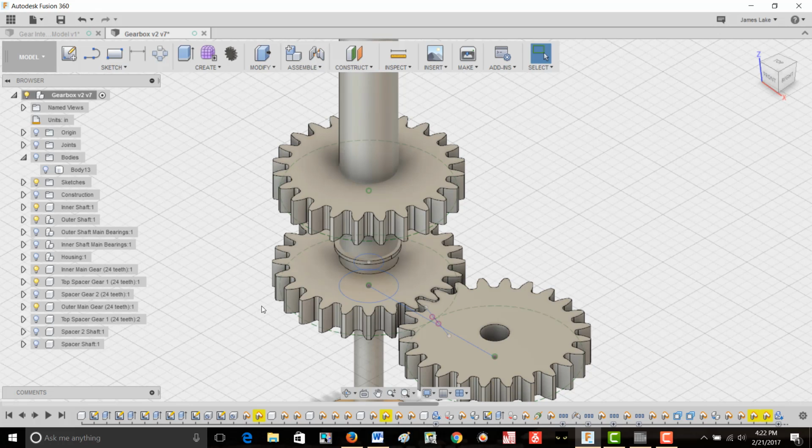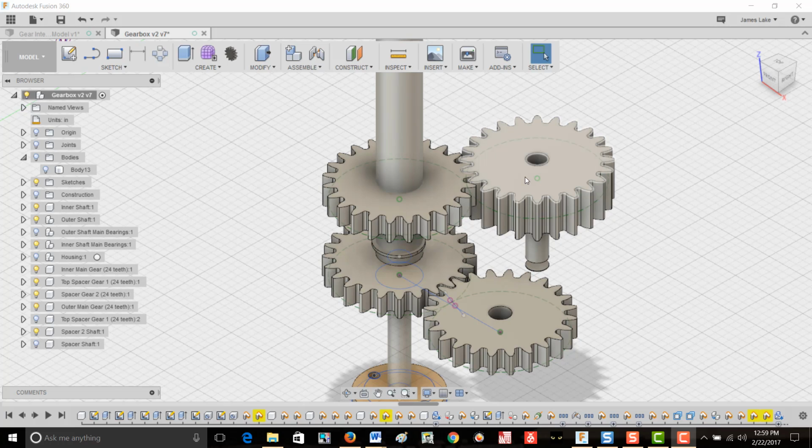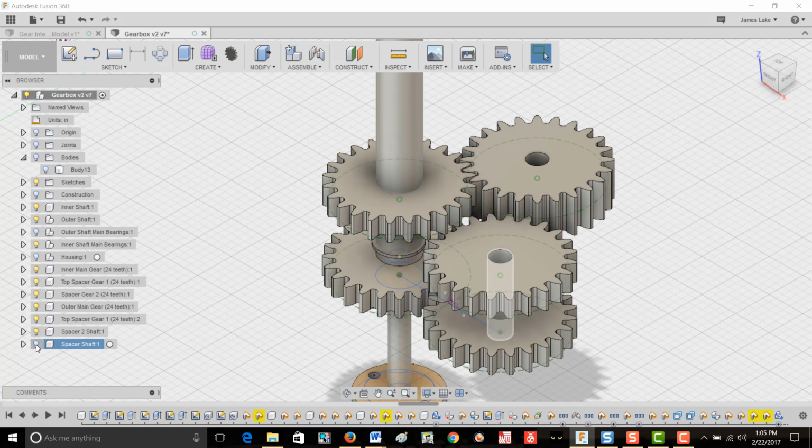It appears that we're going to need another idler to reverse the reversing action of the first idler and use it to drive the output shaft. Here I've added the second idler, meshing with the output gear. Now all we have to do is use the first idler to drive the second idler without conflicting with the other two gears. We can do that with a second gear on the shaft of the first idler. But since it's the same size as the output gear, it has to be on yet another plane of rotation to ensure that the gears don't conflict.